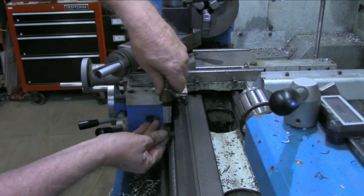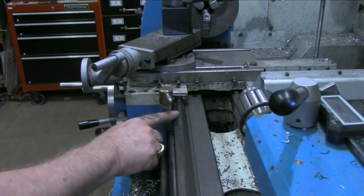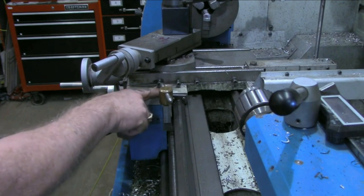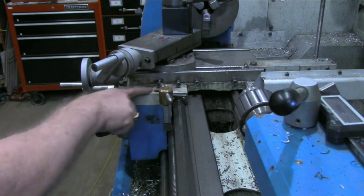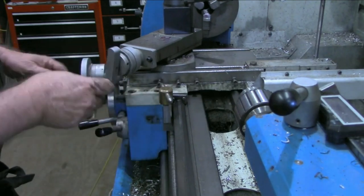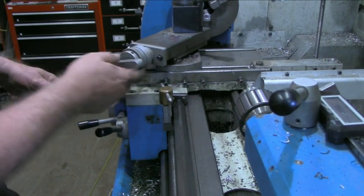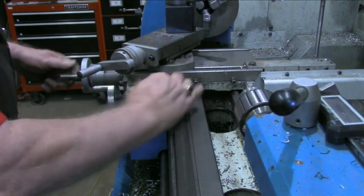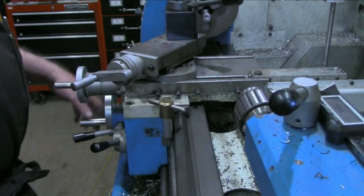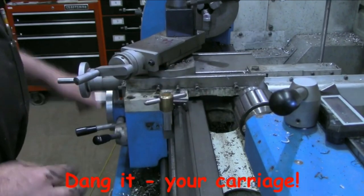Put it in the pass-through. The things to watch for: this piece up top doesn't need to be any higher than your carriage housing, and it doesn't need to be high enough to interfere with turning your compound. But once you've got that, you've got an easy, quick, no-tools-required lockdown of your carriage — sorry, of your cross slide.